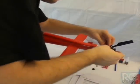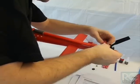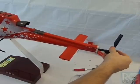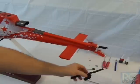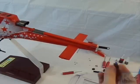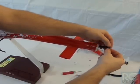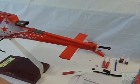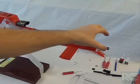On the other side, there are two more Allen head screws that pinch this tail case around the boom, so you'll want to loosen those. Now grab the front of the mechanics and the tail case should slide right off. A little trick to keep the orientation of the belt: take some type of round cylinder — in my case a Dremel wheel — stick it in there, then take a piece of tape so you know your belt orientation stays.